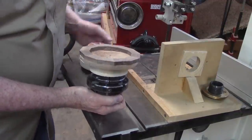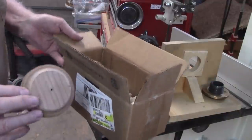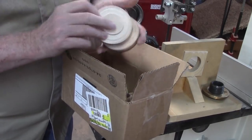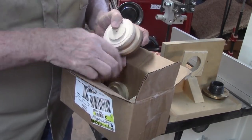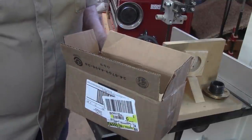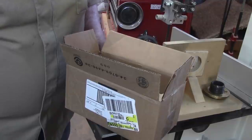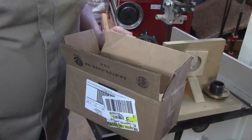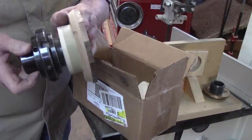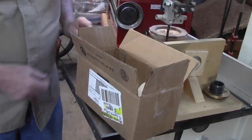What do you use for face plates, what are you holding that with? I make glue blocks — all my glue blocks have a tenon on the bottom. What I like about the tenon is I can take them in and out of the lathe and they're always in register. When you're doing woodworking it might be off two thousandths, but two thousandths is nothing in woodworking. In this case I don't even take it in and out of the chuck — it's just going to go right back in the lathe. It doesn't matter the size of your chuck, it just matters that you're consistent between your machines.